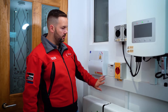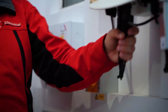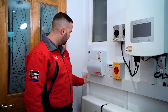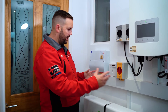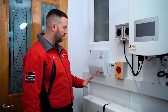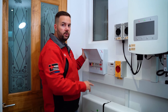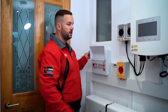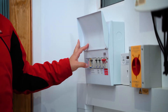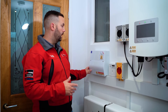One thing that's really important to us on all our installs is containment — having trunking on the wall with all the cabling contained and concealed. Some cable going directly into the inverter is unavoidable, but all the wiring to the batteries, isolators, and meters is contained in the trunking. We put a new consumer unit in on all our jobs: we fit surge protection to the new circuits, we house the energy meter — in this case an Acrel energy meter that came with the inverter — and we've got circuits for the solar inverter, the meter, and the surge protection.